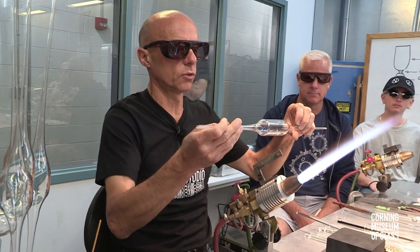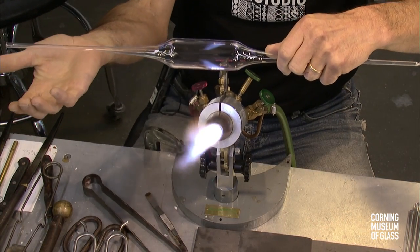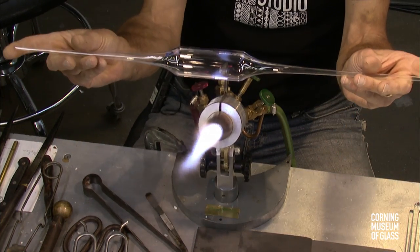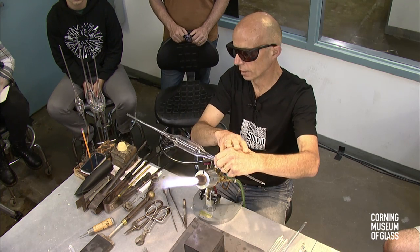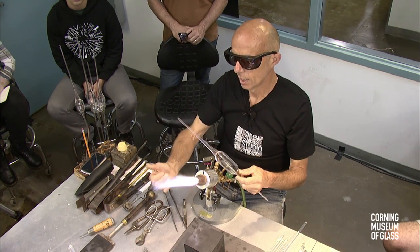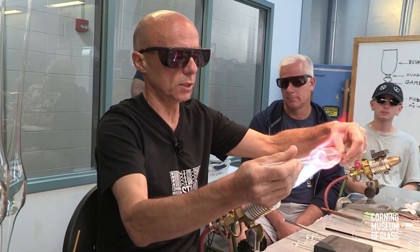So, feet. My left hand is always on top, my right hand always on the bottom. The way I do it is the way I was taught. The German school uses both hands underneath with both holes open so they can blow one side, cap it, and blow the other side. But the American and Italian school use left hand on top, right hand on bottom — opposite if you're left-handed. I don't use a very strong flame; I use a softer flame, and most of my work on tubing is done four or five inches away from the face of the torch.